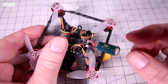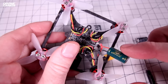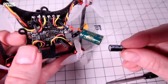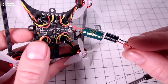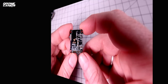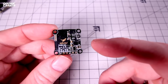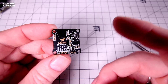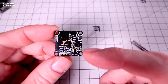What these capacitors do is really clean up your video signal. If you have lines in your video feed, throw one of these caps on your battery terminals — positive and negative — and make sure you pay attention to polarity. Usually on the side of the capacitor there's a little negative marking so you know which side is which. HGLRC includes color-coded wires on theirs which is nice. A lot of these companies really listen to us lately — and what we've been wanting for at least 12 months is 200 milliwatt output, getting away from 25 milliwatt on a brushless micro. This VTX — the TX20 version 2 — is running 200 milliwatt, which makes me really happy.